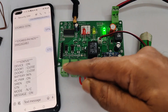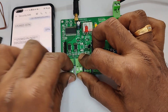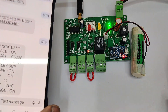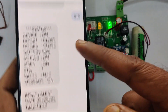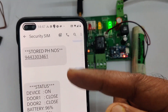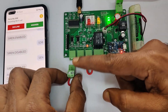When the sensor is triggered, you will get a message and then the siren activates. There are two connectors — RB0 and RB1 — where you can connect sensors at different points like doors and windows. Let us loop RB0. You will get an SMS alert showing 'Input 1 is alert' with date and time, and you will also get a call to the master number. The SMS is sent only once, but the call is repeatedly sent to the master number and all stored numbers until the sensor is open.